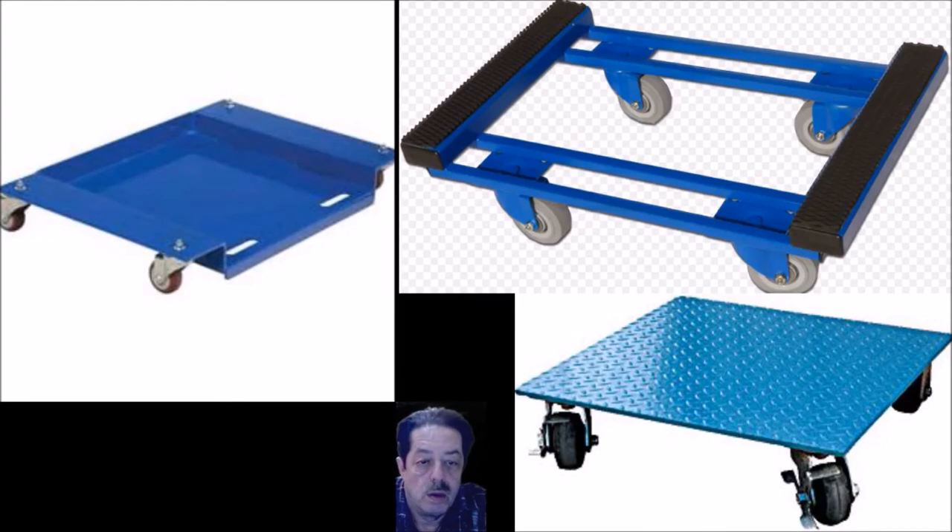Let's take a look at the one on the top left. This is a more low-profile one where you could put a piece of equipment on there, and if it's heavy you can move it around your shop. But if it's going to be too heavy, you want to beef this up by using rectangular steel. I've got another video on heavy equipment dollies you can go back and watch where it's made real stout — made out of thick eighth-inch, three-sixteenths steel. But this is good for light equipment, low-profile, and you can move it around your shop real easy.